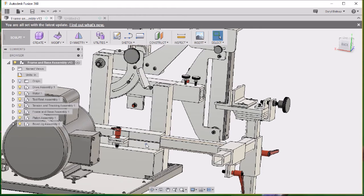I have already welded up the vertical frame and the base frame, and I welded up one of these, and it makes it really, really tight. It's nice. This will slide in and out well, but just a tiny little twist on here, and you get the clamping for that 10 inches of holding that mount there. You've got 10 inches of metal clamping down, so it's really snug. It's tight. There's no wobble.